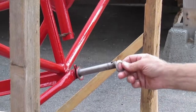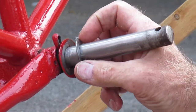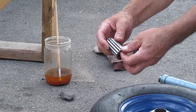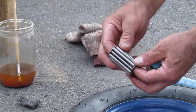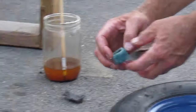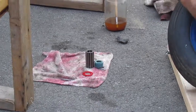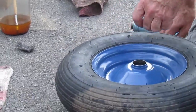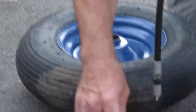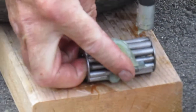We're going to put our first washer on and a second washer right behind that — it's a little tighter to fit. And then we have roller bearings here. These are needle bearings, as you can see, that are kind of an unusual style. We're going to need to slide those into our axle, all greased up. Because on the other side there's a nipple for greasing the wheel, and that's going to stop everything sliding through. So we're going to have to do this in kind of reverse order first. Once again we're going to get some grease here and fill up the bearings.